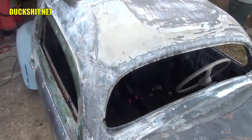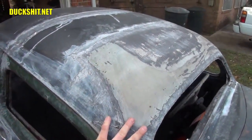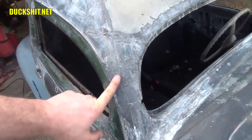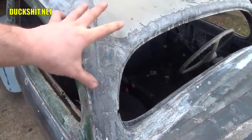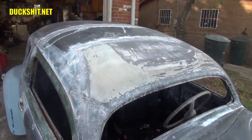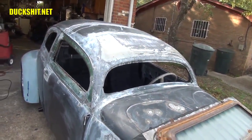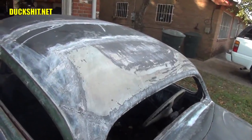These Clecos and clamps were really important to building this car, especially up here in the front roof area. There are so many different panels held together — the original '56 Beetle part, some of the donor roof metal I put in, and these A-pillars which I made. I couldn't get A-pillars from an early Beetle that were in decent shape, so I ended up using some from a later model Beetle, widened them myself, and clamped everything together. So this car looked like a porcupine for a while. I'm going to demonstrate that process in a future video — the building of this car, the chopping of the top, and a whole bunch of other things.